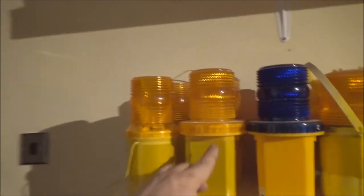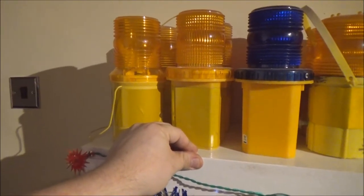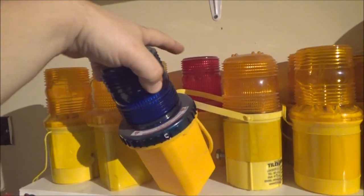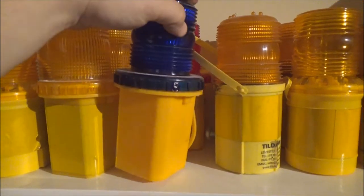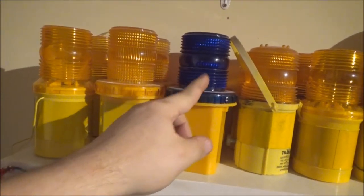It's like these — you can find these and the Chinese knockoffs on eBay as well. The ones that actually hold their prices are these blue ones and the red version. I wouldn't mind one day getting the strobe version of the red one. That one's got the strobe — hence the high voltage warning on it. If you've opened that up straight after turning it on, don't touch the contacts without shorting them out with a screwdriver first, because that will give you one hell of a shock.